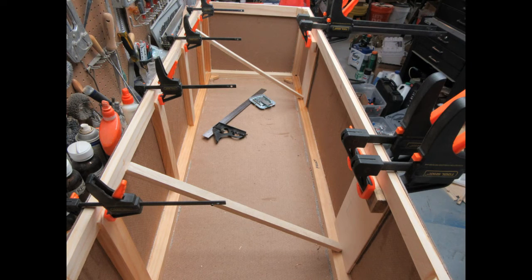Just as with the hinge rails, the masonite panels are not strong enough to anchor the latches, so I use 1/4 inch craft plywood obtained from the local hardware store to form reinforcement plates that span between frame and the wood strip at the edge of the case opening. I use regular wood glue for these. Clamps and blocks secure the top ends, while angled sticks that are wedged in place keep pressure on the bottom ends.